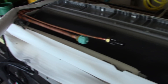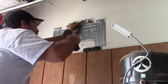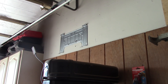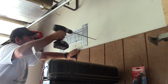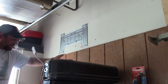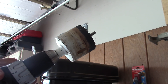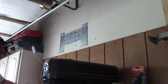I got everything calculated and figured out. I'm just drilling a pilot hole through the wall — it's going to angle down just a little bit for the condensation drain. Now I'm going to drill through from the inside with a two and a half inch, or two and five-eighths inch, hole saw bit. This one's actually 64 millimeters — I'll put a link to that in the description. I'm going to drill from both sides.